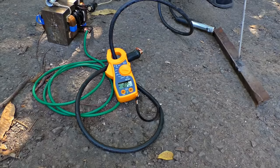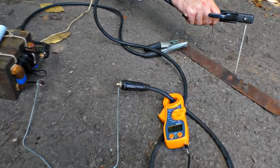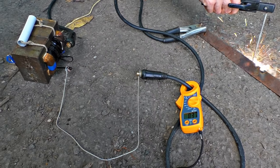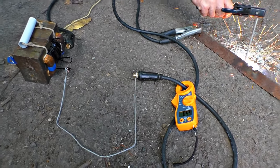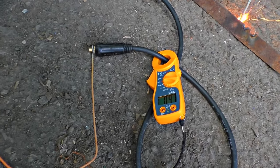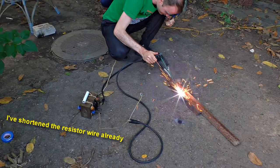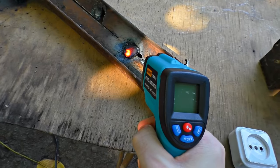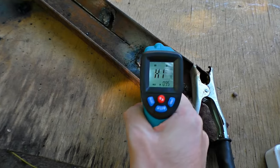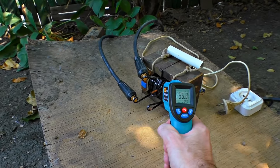It's good that it isn't less than we need. We can regulate the voltage using a ballast resistor. I took a piece of old wire and connected it in series to the system. By regulating the length of this wire we can find an optimal voltage balance. It works! It's 90 amperes now, and the resistor is getting hot — the temperature is optimal.